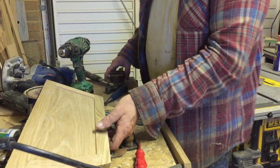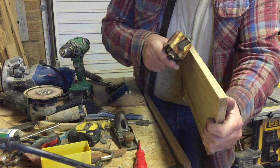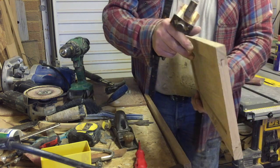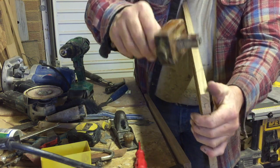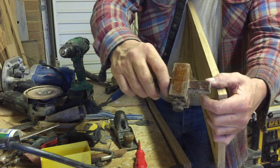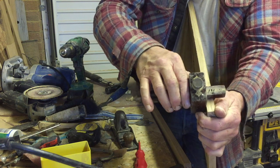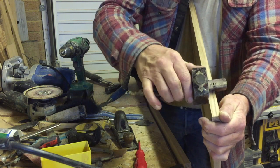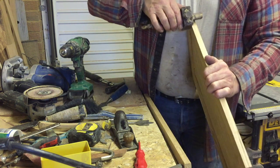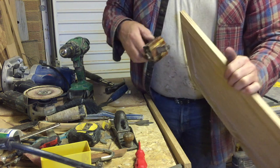I've put the camera down — I want to show you what I'm doing now. I'm chopping out the hinges on the doors. This is what we call a marking gauge — it's got two prongs if you're marking out tenons and mortises, and then one gauge for other markings. I'm marking out when I scratch that down there — that basically gives me the line that I'm chopping the hinges out to.